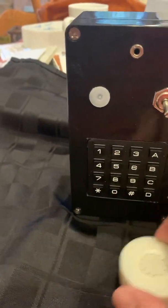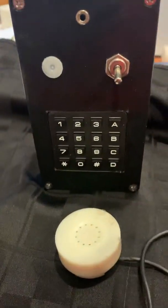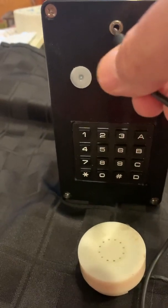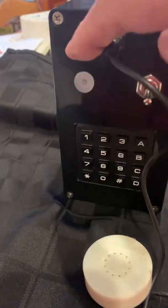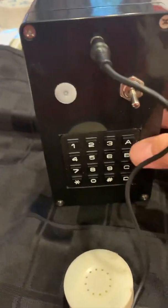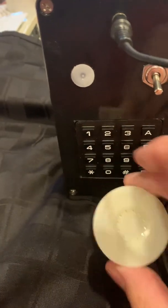However, it will work with just about any speaker, not just the earpiece. There's an audio buffer amplifier added to the circuit that provides some amplification and impedance matching for a low-impedance speaker, so just about any loudspeaker can be used, or it can interface into an amplifier, phone coupler, or something like that.